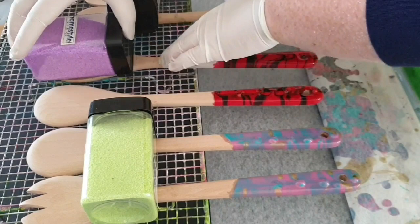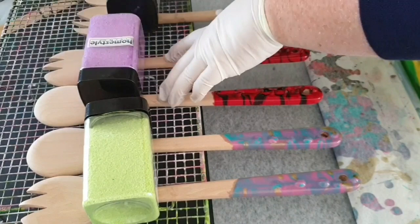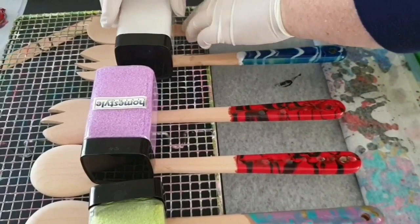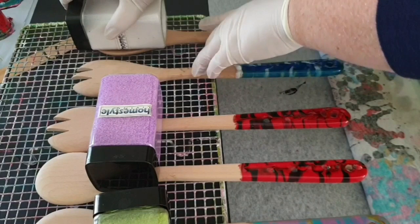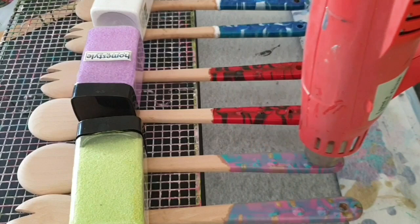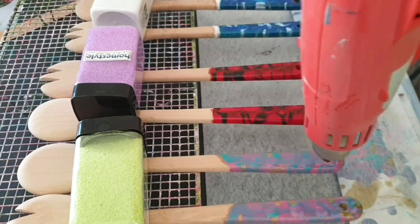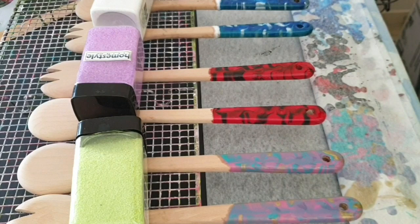I am finding as I peel back this tape — it is just general masking tape — that it has bled a little into the wood grain in certain areas. But this one had no tape. I do need to turn them around to hit the underside where they've got a little bit of a bulb where the resin has dripped, so now just hitting them with the heat gun which is going to soften the resin just enough to let those bulbs relax back in and settle down.